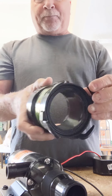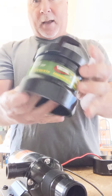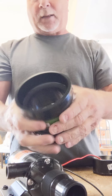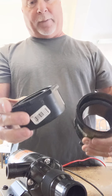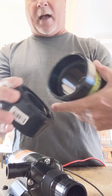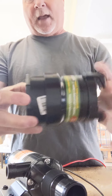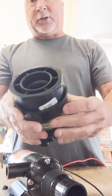First thing I did is I went to Camping World. This has a standard sewer connector where you connect to the RV, and down below is a standard three inch PVC slip-on glue-on connector. I also went to Home Depot and found this adapter, which is three inches on the outside and inch and a half inside. You take the Camping World piece and simply slide it in, put your glue on it and slide it in — now it's one solid piece.